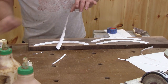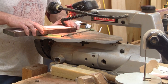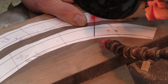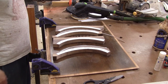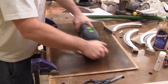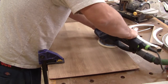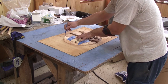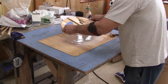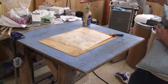While the glue dries, I stick the frame pattern on the piece of walnut and cut the pieces. I only do the concave cut and I start working on the backing of the piece. Before spreading the glue on the backing, I trace the outline. Then I spread the glue inside the line and lay my masterpiece on it. To apply pressure, I place a sheet of parchment paper between the pieces and the sand bags.